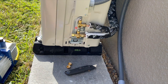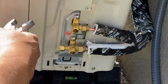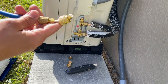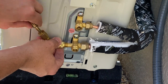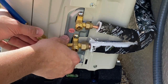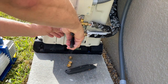What I've got here is a vacuum pump and a gauge set. I'm going to take this cover off — the other two were super loose so that one was tighter. I've got my line going to my gauge set that has my 410a adapter on it, and I'm going to go ahead and place that on my valve here. I bought this on Amazon, actually — all of these tools here I bought on Amazon, and I'll put the link in the description so you guys can pick those up if you need them.